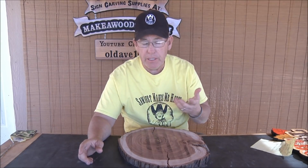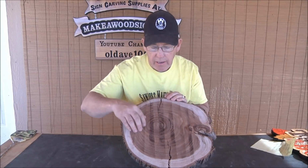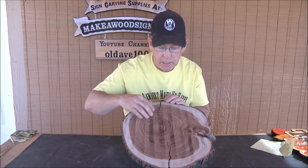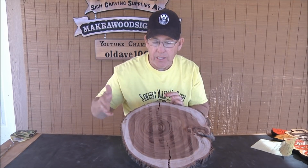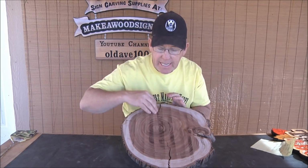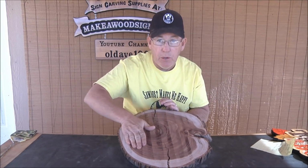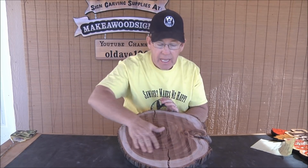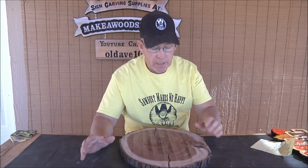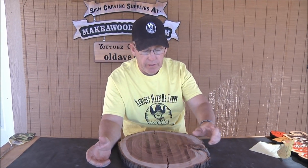for a lot of different reasons, but the biggest reason is that you can see that these are about 1 inch passes. If you go more than one, what we found in the past is that you'll actually get a deep groove there. Even though you can see these passes, it really is smooth. This will sand down, won't take any really aggressive sanding. It should sand down just fine. So that's one thing that I didn't talk about on the video.